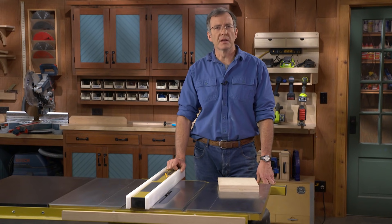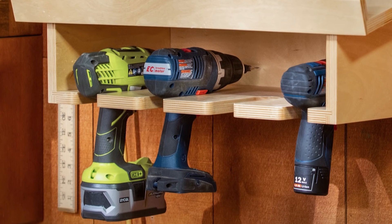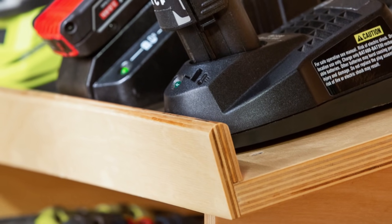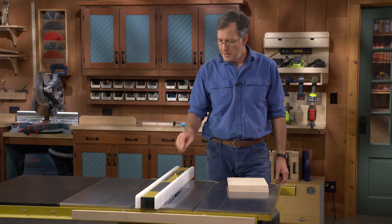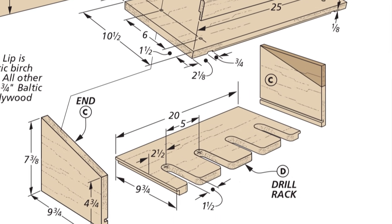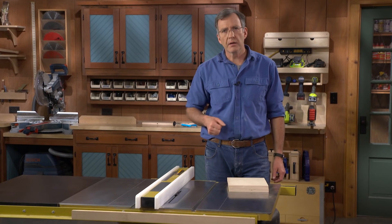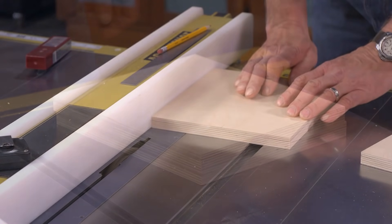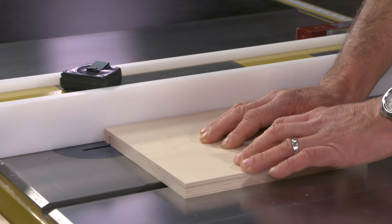With the back completed, it's time to move on to the lower portion of our tool charging station. That lower portion consists of a tool rack on which your cordless power tools will sit, two ends, a top platform for the chargers, and a lip on the front of that platform so the chargers don't fall off onto the floor. I'm starting by making the two ends, with the first task being to cut a groove on the inside lower face of each end piece as part of the joinery that joins it to the lower tool rack. I've got a quarter-inch dado set set up on the table saw — a half inch high and a half inch from the fence.